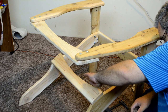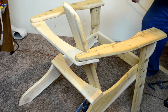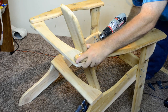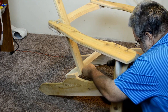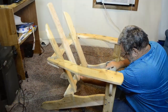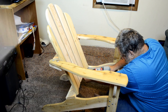Now we're going to go ahead and put the back slats on. I'm going to start with the outer sides first. What I did is measured one inch from the inside of the angled legs and made a mark, put some glue down, and that is the pivot point where the board is going to stay. The top part of the back slat will be leaning against the armrest. Now I'm just going to center up the center board as best I can, and then add the middle boards to the center, also trying to lean them out to where they'll match the outer boards.